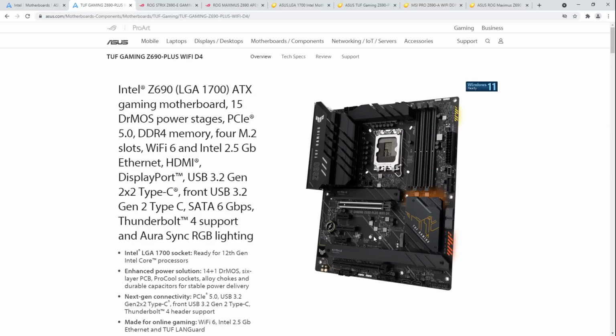That's one of the reasons why I do PCB breakdowns where we talk about the VRM. Back before I started running AHOC, I was really annoyed that you just couldn't get details on what the power delivery on a motherboard was, other than it's got a lot of phases. And a lot of the time, the motherboard didn't even have half as many phases as the box said it has. They'd tell you a fake phase count. They wouldn't tell you what actual components it uses. And, you know, good luck, have fun.